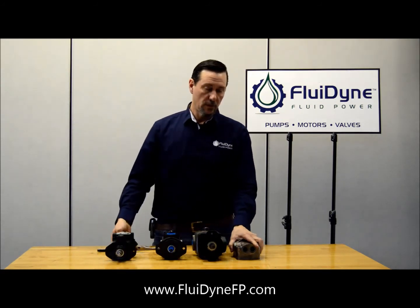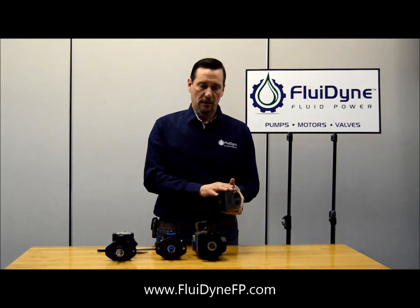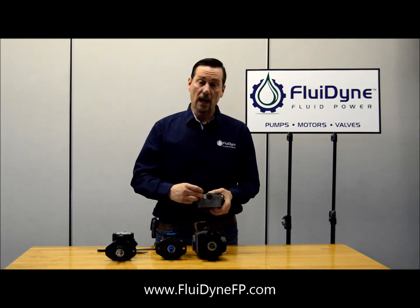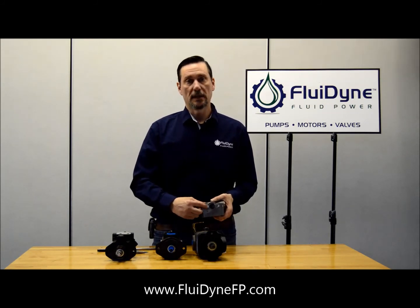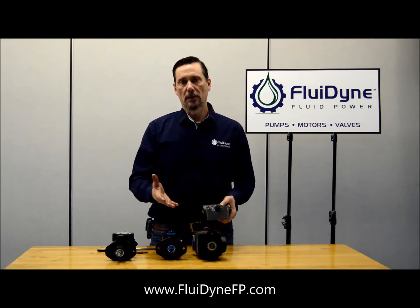The other cover here is a V20 P-Cover, a priority cover. This does not have one of these relief cartridges in it. It has a poppet seat and a spring behind this plug here to adjust your pressure setting. There's really no way to tell what your pressure setting is if there's no number on this pump for a model code — you pretty much just have to run it, test it, and put a pressure gauge in there to find out what your pressure is set at.